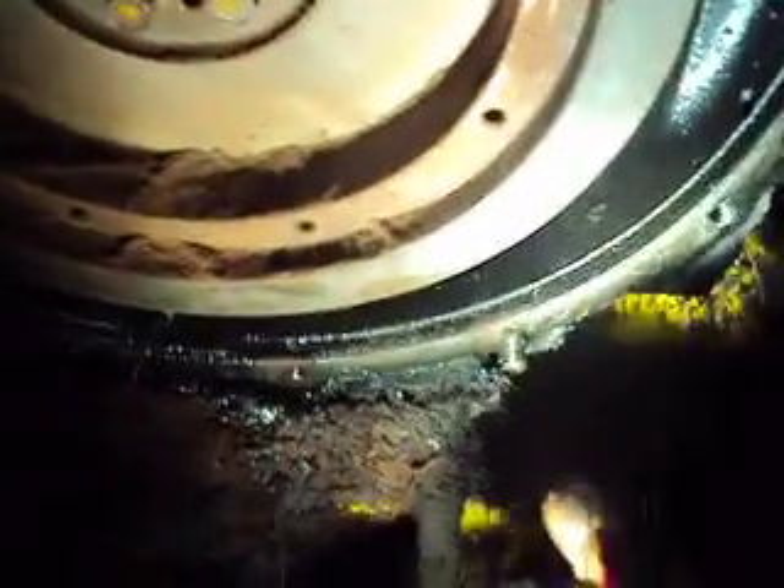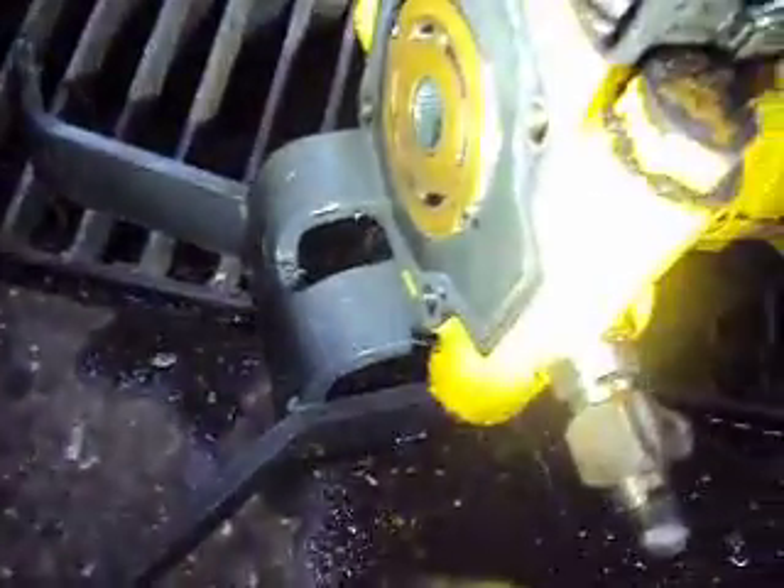It's kind of an expensive mistake. I'll show you here - this is the flywheel. You can still see the remains of the bolts that held the bottom bracket on; you can see the heads are busted off. So somebody either used two soft bolts when they mounted this thing, or they just didn't tighten things down very well. You'll also notice that this part of the pump assembly has some nice yellow paint on it, and this part here has no paint on it, so this has been done fairly recently - maybe trying to fix the same problem, but they obviously didn't do a very good job of it.